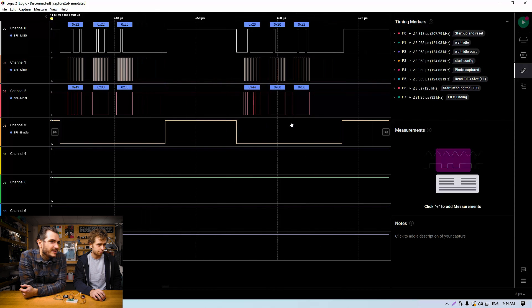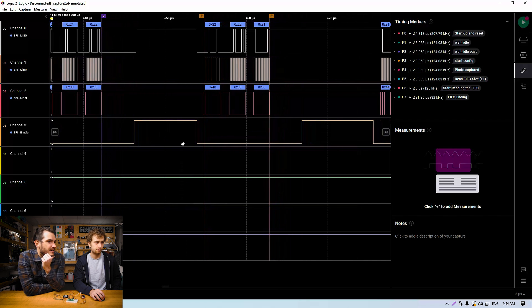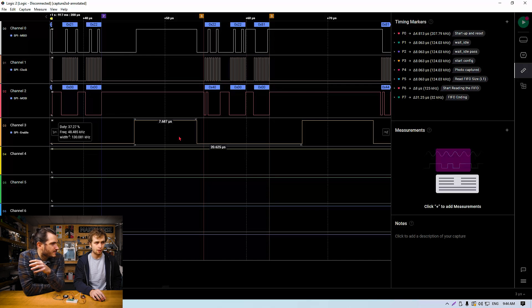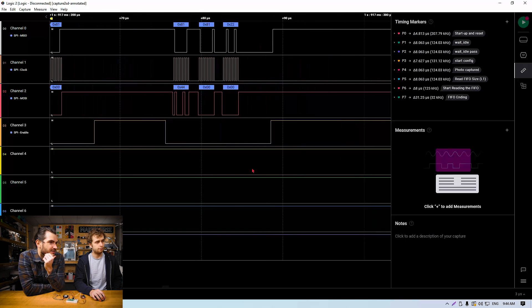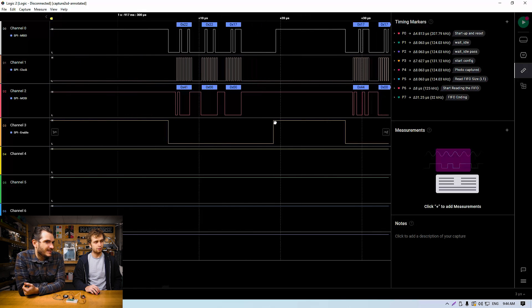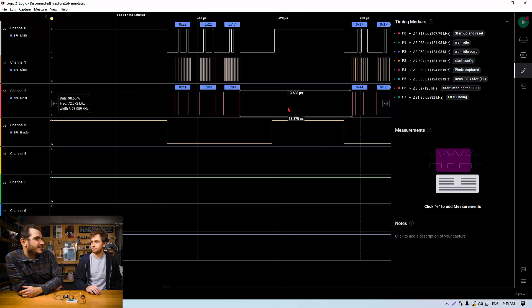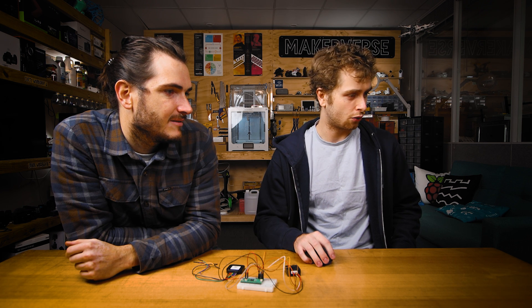You can see there are lots of commands in quick succession during startup, and then we start doing some config. Is this all copied essentially byte for byte into the new MicroPython driver? Essentially yes — we're taking that example and extracting it out. The Arduino driver sets it up a certain way and we're first copying that, but then we have to extract out the bits we can play with, like resolution or capture mode. We develop those changes based on what we can gather from the three sources: the Arduino driver, the MicroPython port, and the Saleae capture.